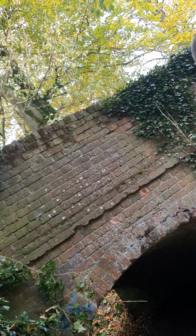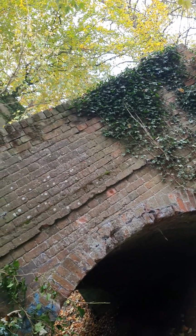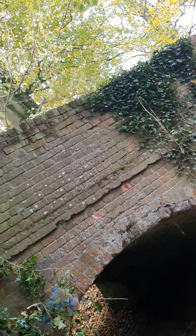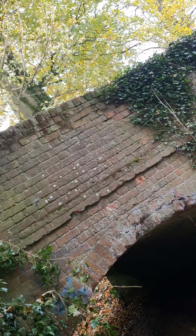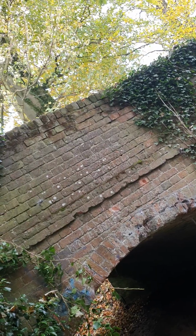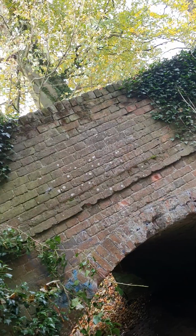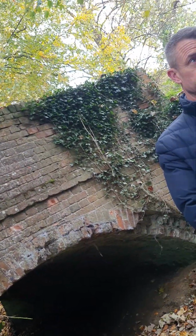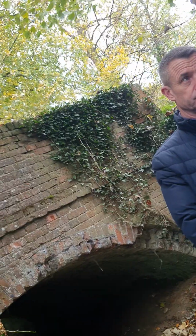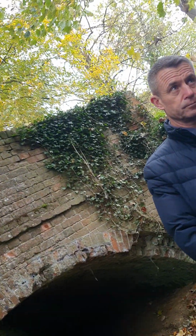I think you go for wherever your culvert is, and you might have to do it. It doesn't have to be as high as that, I don't think. But even if you get some muck and batter it up around it to form it in, because a lot of this one is that size wide, you can see all the roots coming out the side. It's difficult. Does that need to be part of the same casting, so that it's all bonded together rather than adding it on later? You can have some starter bars coming out the side. Yeah, and then we can do a detail.